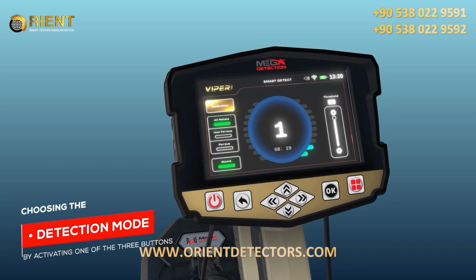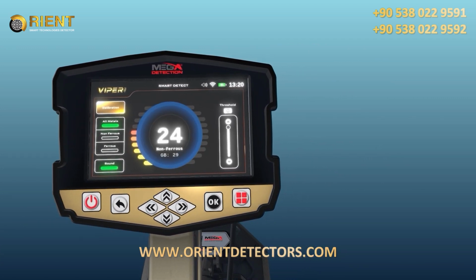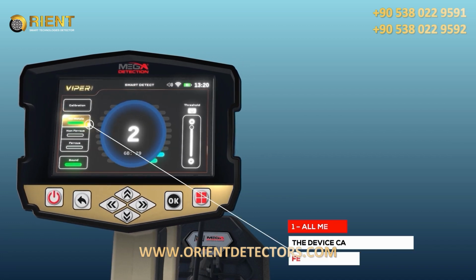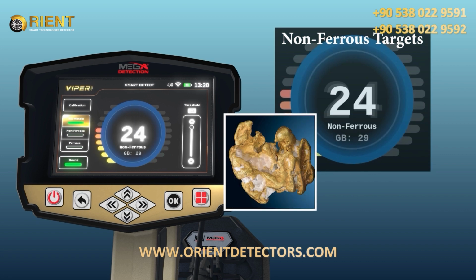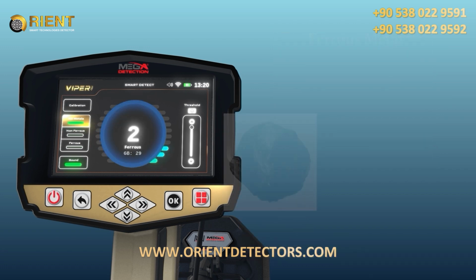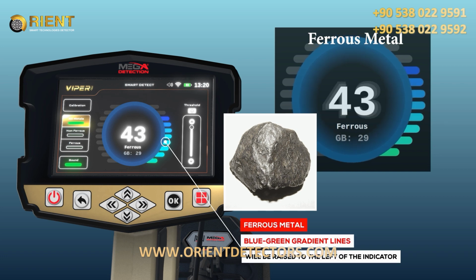Detection mode. Choosing the detection mode is done by activating one of the three buttons corresponding to detection mode. They are: 1. All metals. It is a general detection mode. By activating it, the device can receive signals from ferrous and non-ferrous metal targets. When a precious or non-ferrous metal is detected, the yellow-red gradient lines will be raised to the right of the indicator. When it detects an object of ferrous metal, the blue lines will be raised to the left of the indicator.